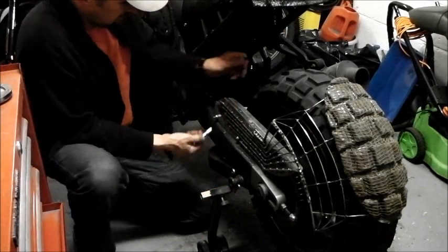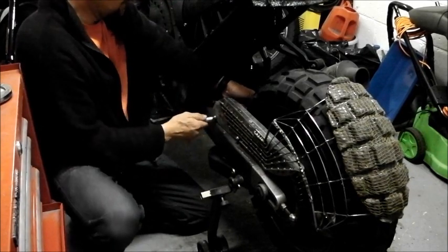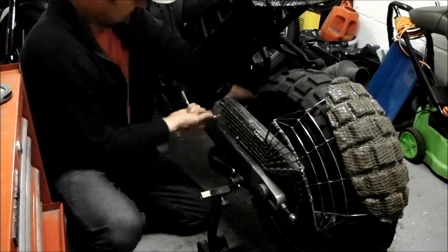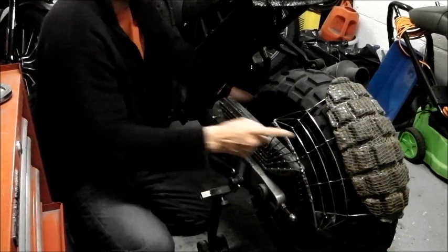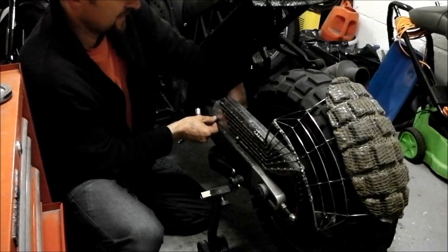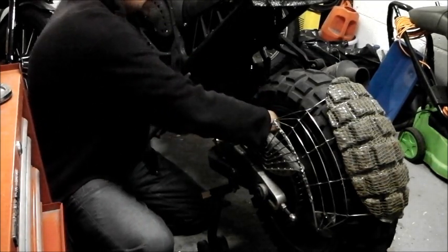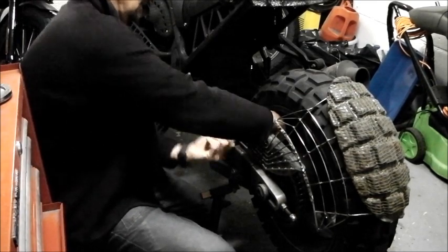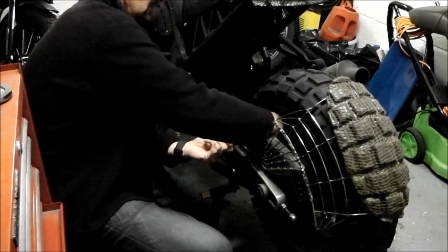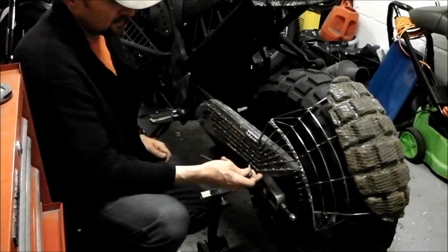Right, let's get it off and make those holes into slots. I'm kind of expecting when I take it off that the whole thing will spring out in completely different directions, purely because of the amount of tack welds — there's about 50 tack welds I've done since this was one piece on its own. That's a lot of tack welds and each one has an effect on slightly distorting the overall item. If it stays in one piece and one shape, I shall be rather pleased.